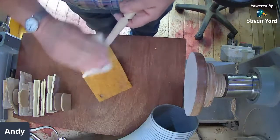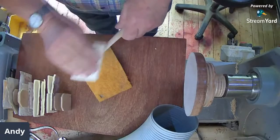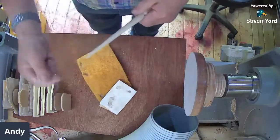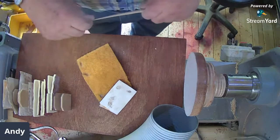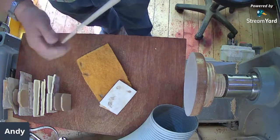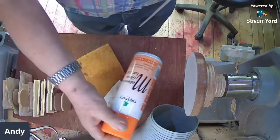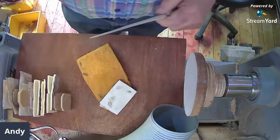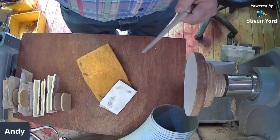Obviously I need to do all of this again, particularly down here where it just caught the edge of the sanding disc — which it always does. I'll do that at my leisure. Then I'll spray it — give it a spray of sanding sealer, cellulose probably, and maybe an acrylic lacquer on top, or melamine. Melamine is probably quite good because it's hard wearing — people will be picking it up. We just had the delivery from Chestnut this morning, so I might try some of the spray melamine in a can.